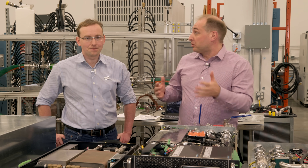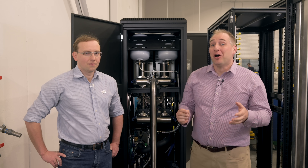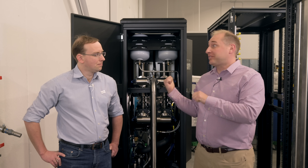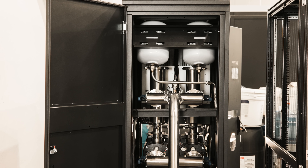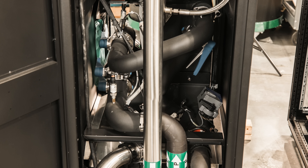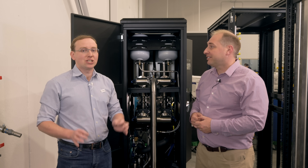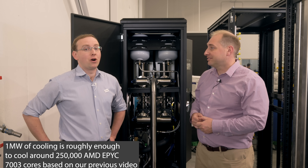Now that we've seen these CDUs and talked about how much goes into them, let's look at a big one. What I saw while walking through the liquid lab was something super cool — what it looks like when these things scale up into the megawatt class of cooling. We're talking about the same cooling distribution unit, the same CDU, but the story has evolved into gigantic sizes. It has absolutely the same components — redundant pumps, control electronics, expansion tanks, heat exchanger — but everything is just massively giant. It takes a lot of effort and time to get that working together, but when it does, we're talking about megawatt scale.